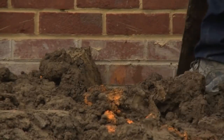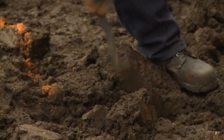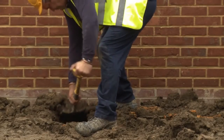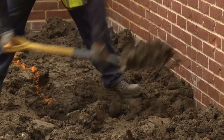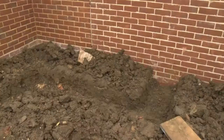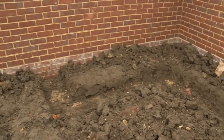Foundations, or footings as they're sometimes called, aren't always necessary with a small wall that is less than 600mm high. If you have an existing concrete base or an area of firm and stable paving, you could build straight onto that, but because our planter is going into an area of garden, we'll need to form a simple strip footing using concrete.